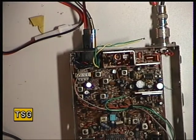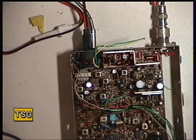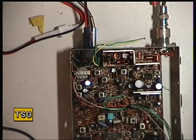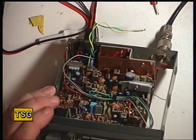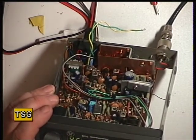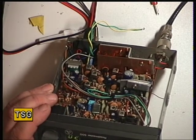Now we need to see the S meter. Now the S meter, normally you would have S9 as 100 microvolts. I'm putting a 100 microvolt signal into it. I think what we need to do really, with it only having 4 lights, is probably just have it hover between the 3rd and the 4th lamp on this bar graph display.